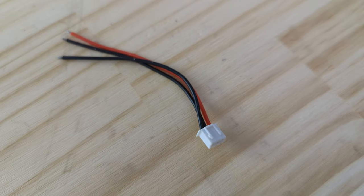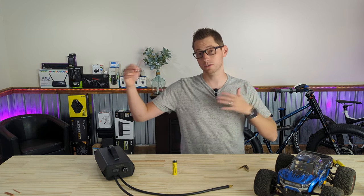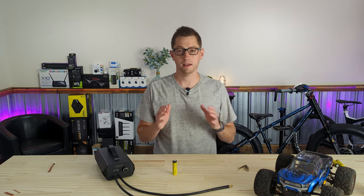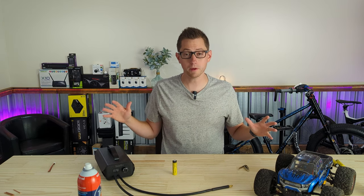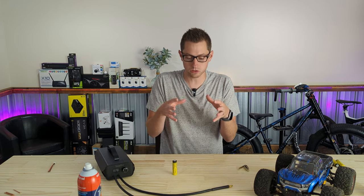Because I'm building an RC battery, you're going to need a balance wire. My specific battery is a 2S2P — 2 series, 2 parallel — so I needed a 2S balance wire. You use this because your RC charger has all the balancing intelligence built in, so you don't need a BMS on the battery. The battery stays smaller, and when you charge it, you plug this in so the charger can monitor which cells have what voltage. You might also need a fire extinguisher.